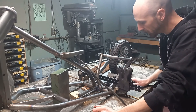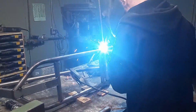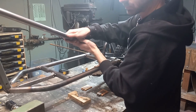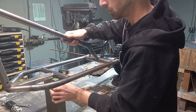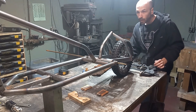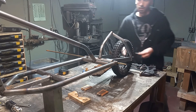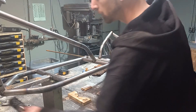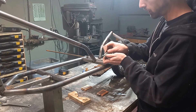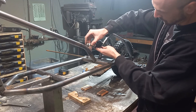The key when doing this kind of work is make sure you use every clamp that you have. That's straight — awesome. Now we can do our shock and connect these two. We're just using one of these cheap eBay shock things, and we already cut out a handful of brackets so we'll just bolt these guys together. Wherever it lines up on here is where we'll weld them in.